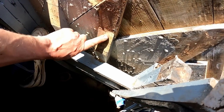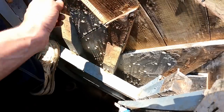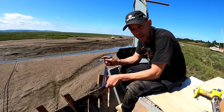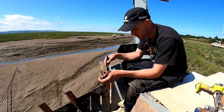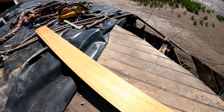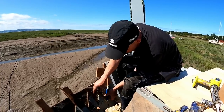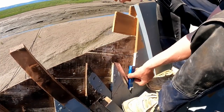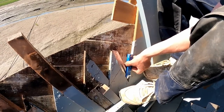Right, so we will come down a bit more with these scarves, but it's given us space now, hasn't it, to do these planks. Right, plank time, so we do it quite efficiently now, don't we? We bring the whole massive plank out, we put the angle on it, and then we get no waste, it's great. So basically, bevel in, follow our line there, so we know that's going to fit down there.